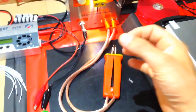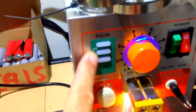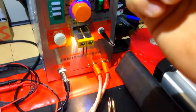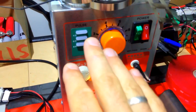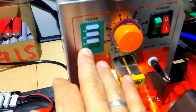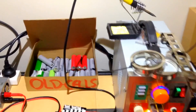I've got a foot throttle here — it's like a pedal so I can hold with both hands and activate on the pedal. And I have pulse options. The cheap welders don't have these options. This increases the time the short circuit is held, which increases the heat amplitude on the tab — so you can do really thick spot welding for high-powered batteries.